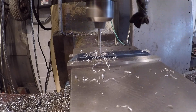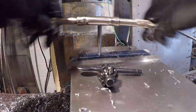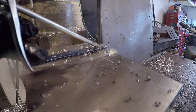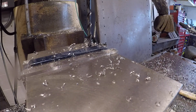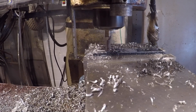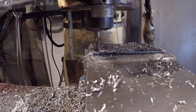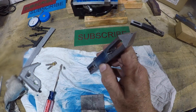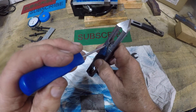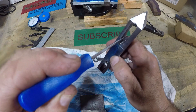I drill and tap for a quarter-inch bolt that will be used as the jack screw. I drill a hole at each end of the slot, then mill the slot — this is looking pretty good. I had a little blowout on one end where I took the slot too far and it cut into the threads. No big deal — the threads still work.